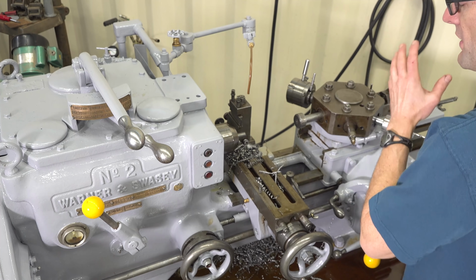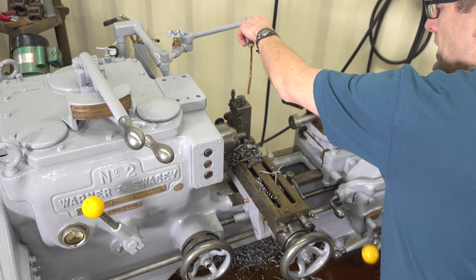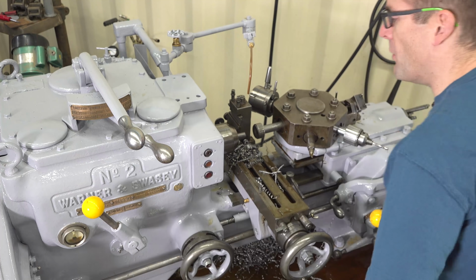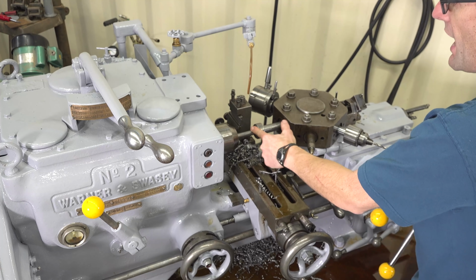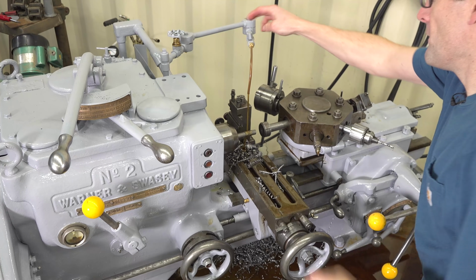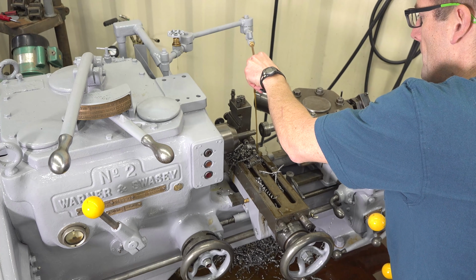Okay, so I've got the rotary phase converter on. We can start the spindle and I'm going to advance the depth stop here. We'll unclamp the material, pull out the rod. It's just a setup that I'm experimenting with here. So this gets us out to the correct depth. Now we can start our spindle, and add some cutting fluid here.